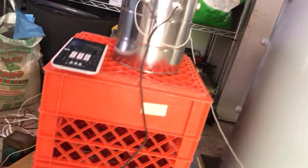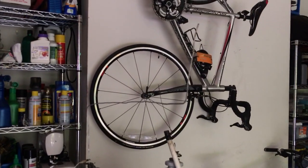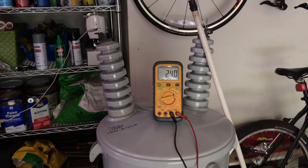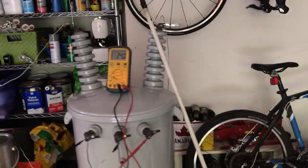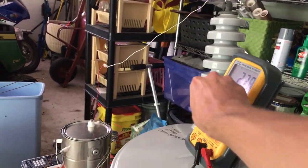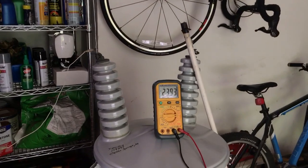What I'm going to do now is just power the circuit up and see what happens. I can get the plug in the socket — there we go. I'm going to have to watch out because that wire is now live at 1,900 volts. You can see we're getting actually a perfect 24. Let's see if we can dial down the scale here without getting too close.